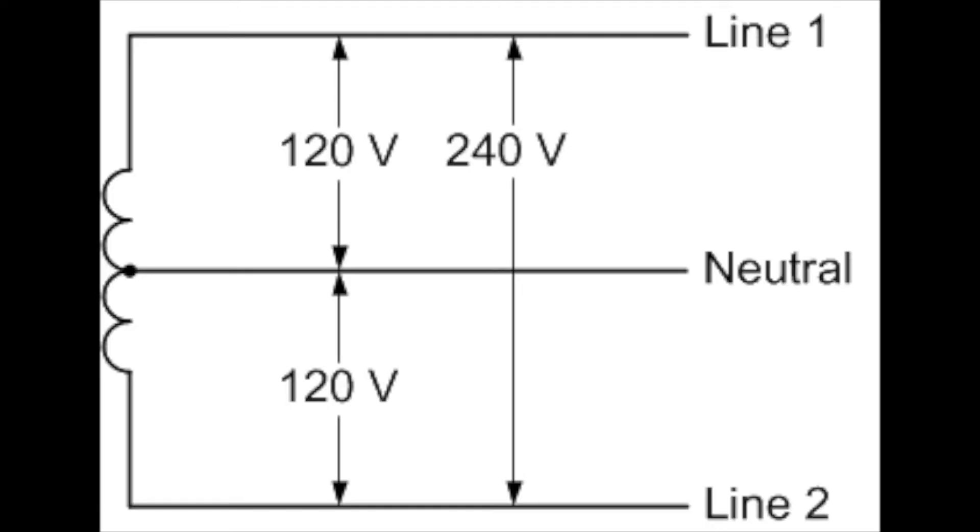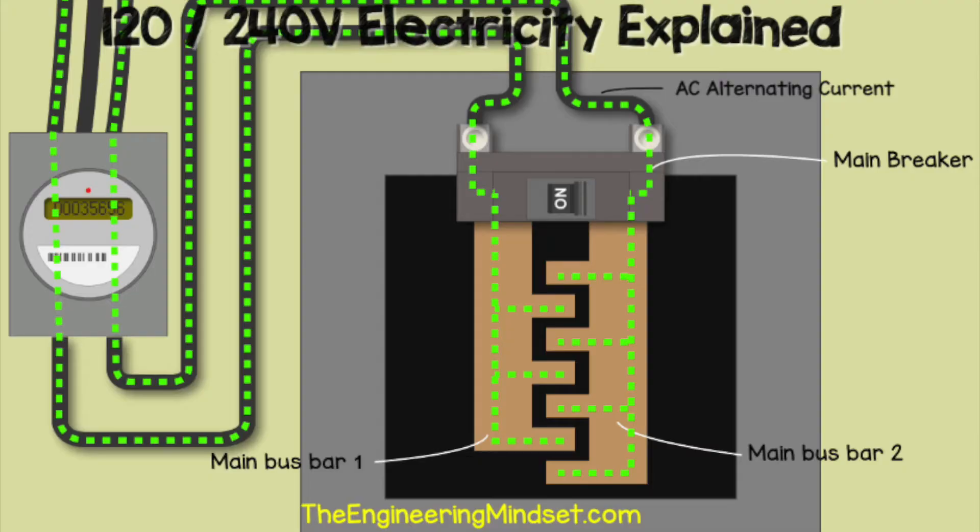Just a quick recap: in our homes in North America we use Edison 3-wire, which is a combination of 120 and 240 volts. The 240 volts comes in on two what we call hot or live legs inside the panel, which also has a neutral between the two that gives 120 volts to neutral from each of those hot legs. That means inside the panel, each single-pole breaker that controls just one circuit is going to be 120 volts, though from top to bottom in your panel they alternate between which of the two hot legs is powering it.